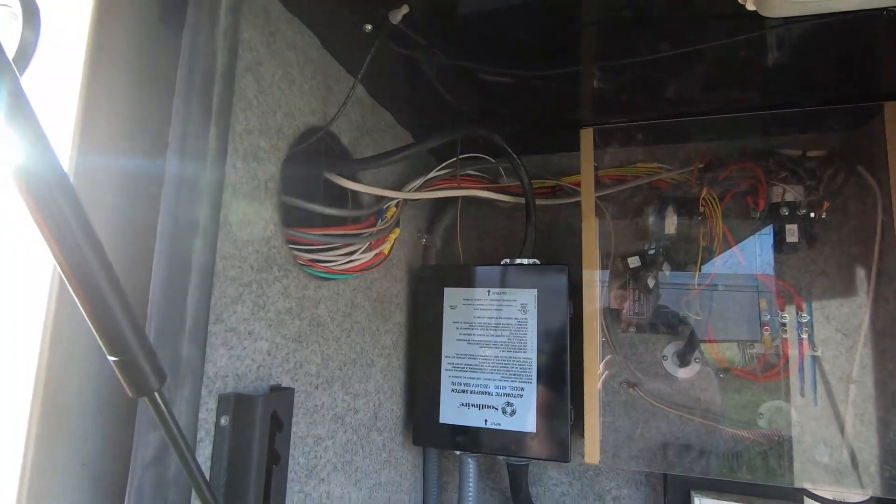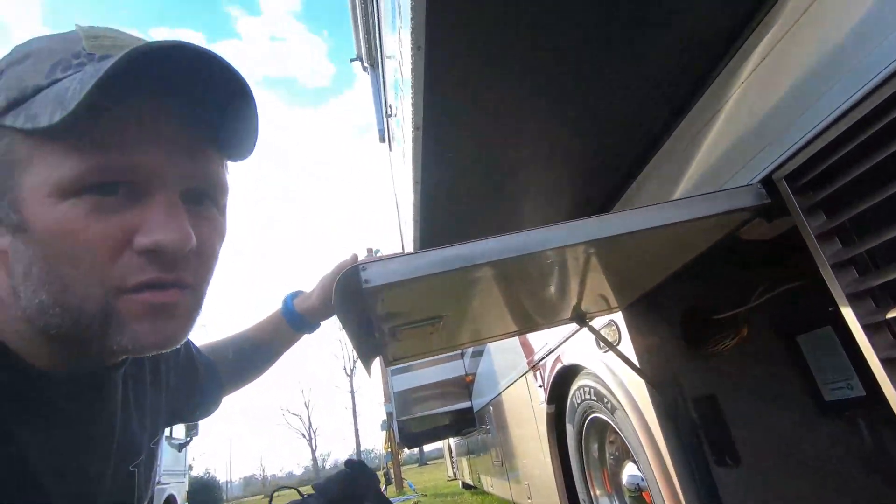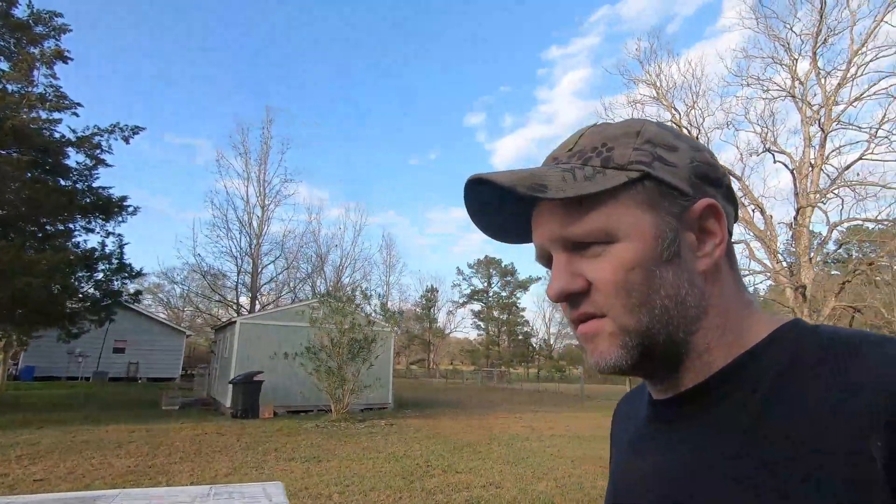There's no way for me to bring that wire down out the other side, so what I'm going to do is go get some more wire and essentially splice it to another piece and run that directly to my inverter, then run one back up. I've got to go get that and a couple of other little wires to connect everything — so it's a hardware store visit.